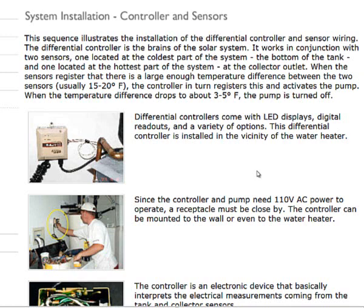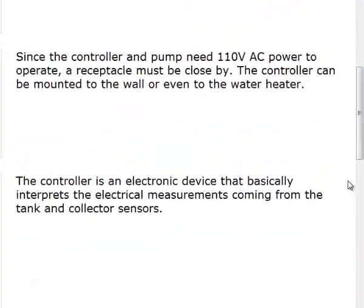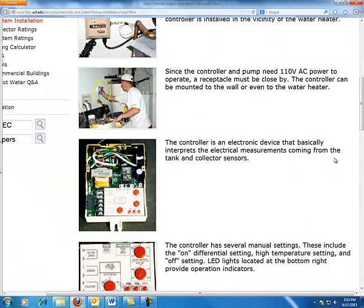There are many products out there that claim to have a variety of set points that are better than the rest. Certainly when you're dealing with solar thermal heat extraction, there are a lot of algorithms required. But the moral of the beast is that a very primitive, simple controller is really the best — a robust system that monitors the two different temperatures from the tank and the collector and turns on and off that pump.